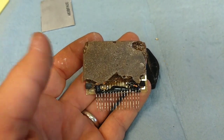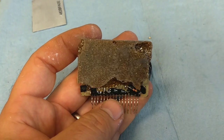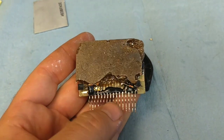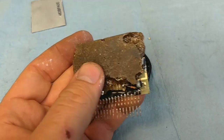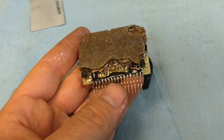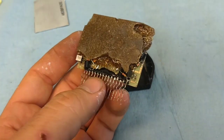The reason I know that is because of the horrible crossover distortion that occurs under load and rectification under load. When I take the load off it looks good, so something in here — one or more components — is open. That could be because the potting compound ate through it or because of a manufacturing defect, but you'll really never know.